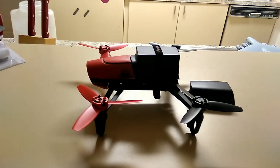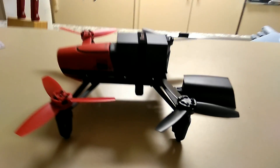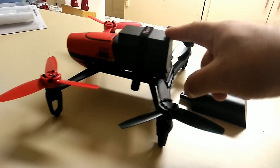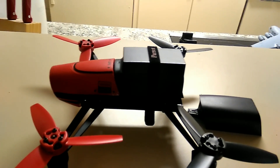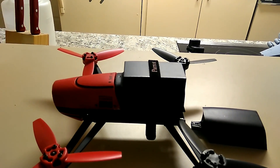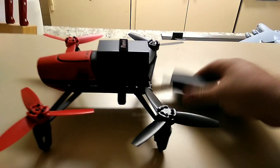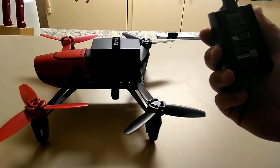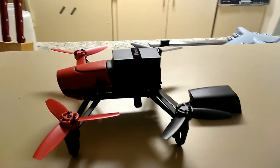So we are now going to compare the 12 minutes I got with this battery. By the way, I let it go all the way until it force landed — it landed on its own at 4% battery. So that was the flight test of the Jiffy 2500 milliamp: 12 minutes roughly in a hover test. You're probably looking at a calculated 14 to 15 minutes of regular flight time. So let's put the stock battery in here, this 1200 milliamp, and run it until it runs dead, just so you guys can have an idea of the difference between the batteries.